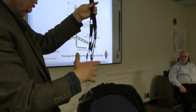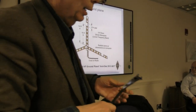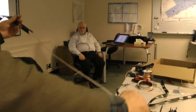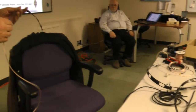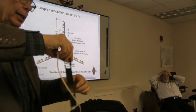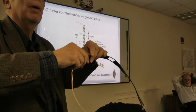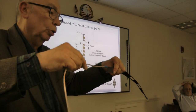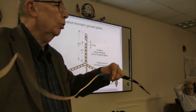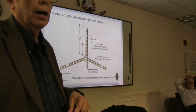But it's actually not too difficult to do. These are held together with screws. I also looked into an alternate way of attaching the wires. This is a more expensive way. These are called posi locks. They're threaded, and you put them together by hand. There's no crimper, no screws. You get a perfectly straight line right through. I wouldn't put this with a huge load endwise on it, but for a moderate load, for a small antenna, the posi lock is a way to go.